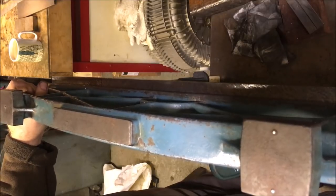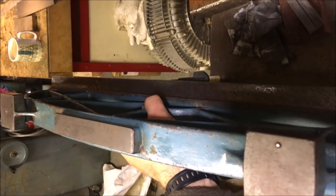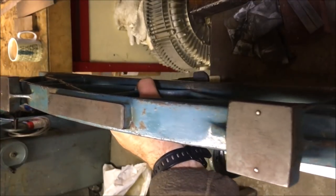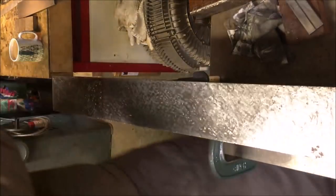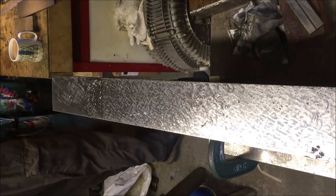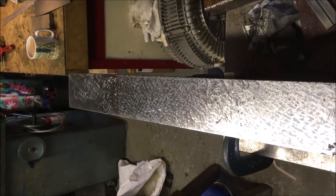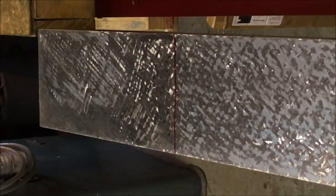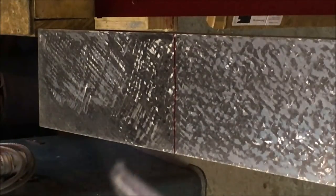So that's the heel down in the middle, on at the far end. There's not an awful lot of ink on that straight edge. Should we use zoom? So you can see the ink's picked up down the middle on this far side, this edge being a bit lower, and there's spattering. So just scrape that one off.